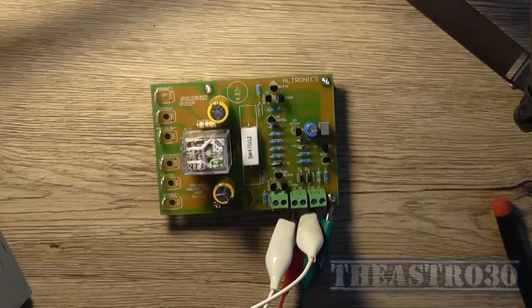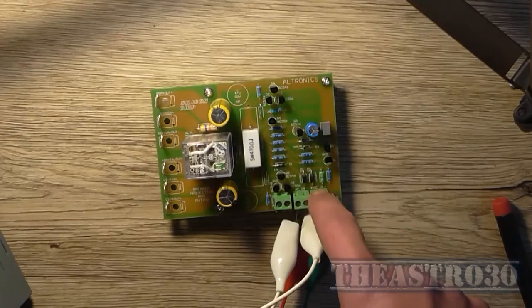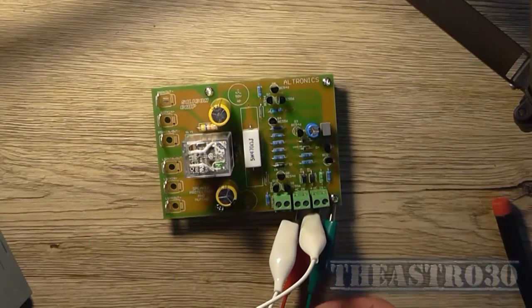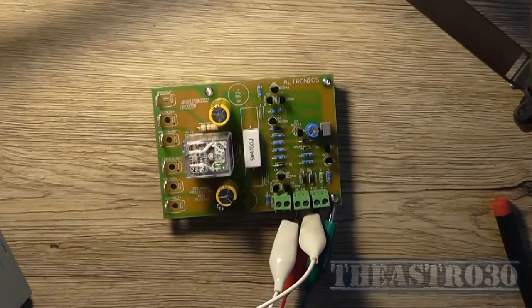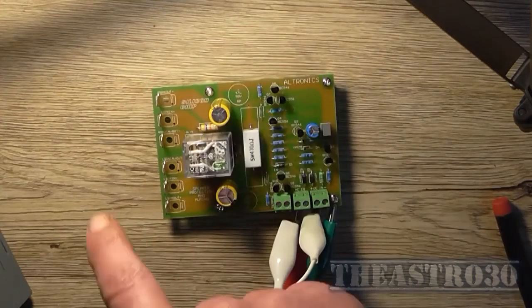I've got my supply set at roughly 36.2 volts, using both power supplies in series to achieve that voltage. For testing, I've connected one side of the AC loss detector to the positive rail, and the green wire — the zero volt rail of the amplifier — is the negative reference. This ensures the circuit references to the amplifier zero volt rail correctly, otherwise it won't detect negative DC on the inputs. First test: turn it on and see if the relay pulls in after five seconds. It does — looks like about three seconds. The relay also has an LED indicator.